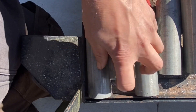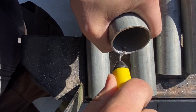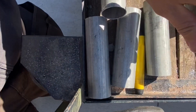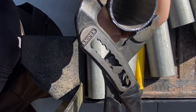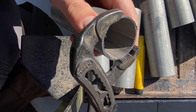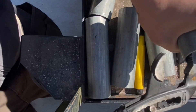Once you've cut all your pieces, you've got to clean them — you want to ream them. I think this is the most important part. Put your finger on the end: if it won't cut your finger, it won't cut a wire. And for the outside edge, my top choice for reaming the outside is the Knipex water pump pliers — they're almost sharp in the jaws, really nice steel. You do that so you don't cut yourself when you're working with this metal. I just love the reamer.